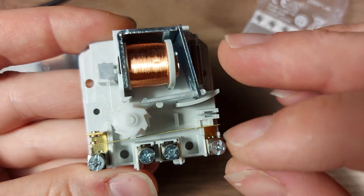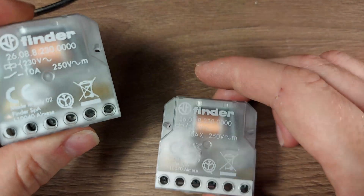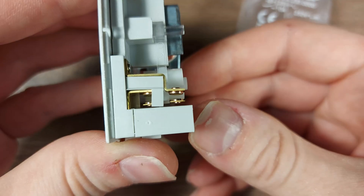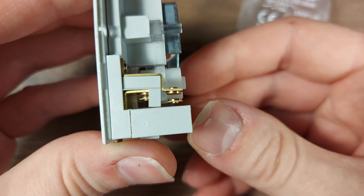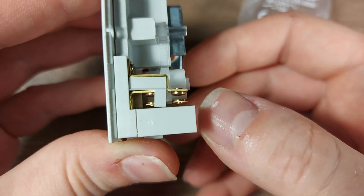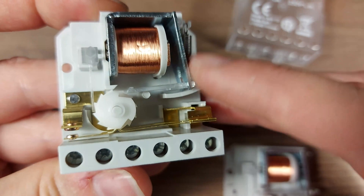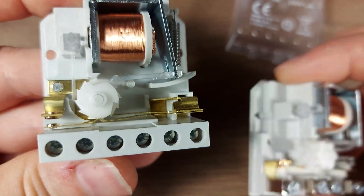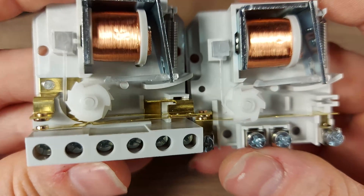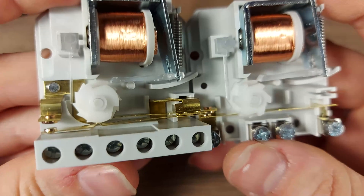This is much more simple and reliable. I have another one which looks identical but it has two contacts on the inside. As I actuate it, the left one closes, then the left one opens, then the right one closes, then the right one opens — so the two work independently. This one has a similar cam and gear profile except the cam lobes are slightly different, and you can easily imagine that depending on what kind of switching pattern you want, you choose the cam lobes accordingly.